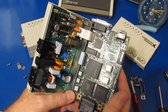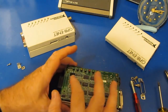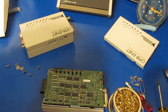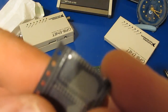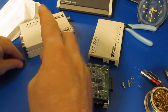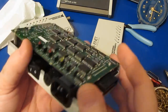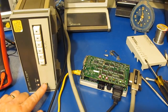The real nice thing about using these is that all the equipment is accessible on Ethernet, so I can actually run it from a remote wireless system. I'll get the heat gun out and go ahead and remove these chips. Here are our new parts — this is the 160 and these are the 162s. I'll tack these in quickly, plop a few screws back in. If you own one of these and have to take it apart, these little brackets are probably the easiest way to reassemble it. Drop the circuit board down and then remove the brackets when you get ready to install the cover.